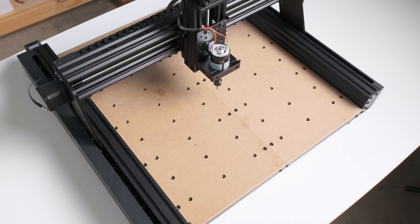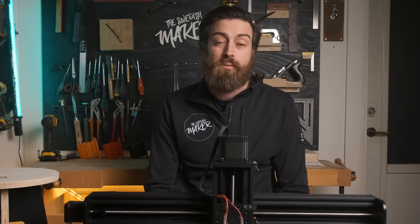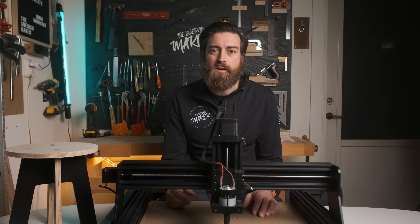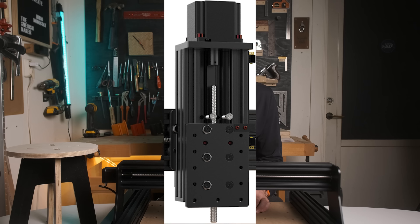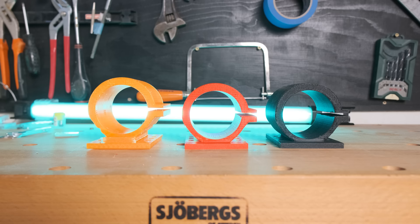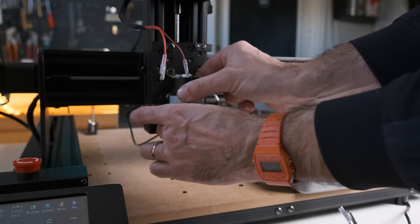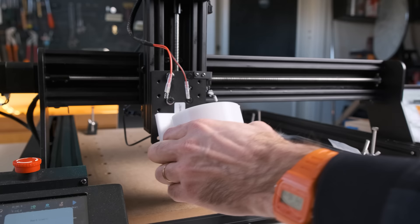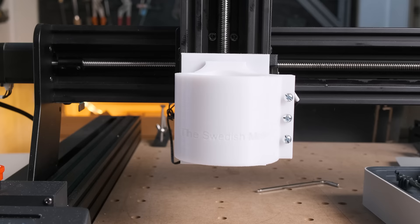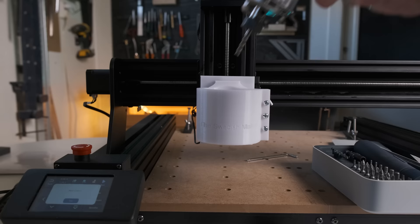Since I hadn't ruined the entire piece of plywood just yet, I decided to make a step stool instead. But before that, I wanted to see if I could upgrade the CNC right away. I was disappointed with the spindle, so I asked the company what the dimensions were for the backplate holding the spindle, because I wanted to 3D print a mount for a better spindle like the Makita router I have. But they said it was a company secret. So once I designed it myself, I could 3D print it. I made a couple of iterations before I got it right, then attached it with the already provided screws. This is just PET-G plastic — it would be good to get this in aluminum instead, but for now I think this will work. I added the Makita router to the mount and it seemed sturdy enough.